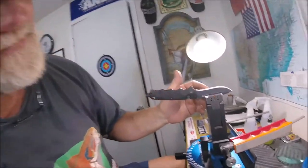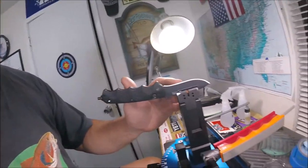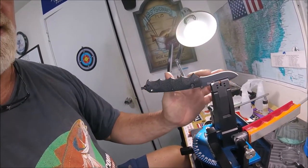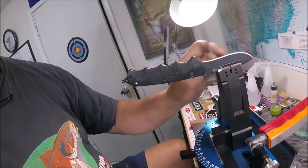It's a USA black blade — me and the black blades, I love them, because by the time I put a mirror finish on it or even just a working edge, it really stands out, as you can see. I'm having to practically re-profile this knife. It came with 24 degrees on each side and I'm using the 100 and 200 grit right now, scrubbing this side and trying to get a burr over on the other side, because then I will have found my apex.